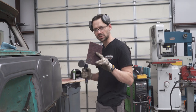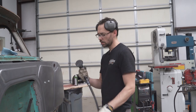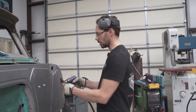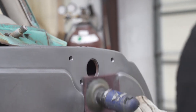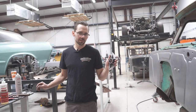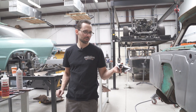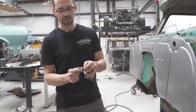Then I'm going to use some 80-grit hook-it three-inch abrasive for my DA sander — also from JAG10 Tools — to blend out the Scotch-Brite scratches. For the final step in our metal finishing process, this is a coarse red Scotch-Brite. We're going to take the abrasive disc off and just use the velcro backer part as we buzz around for the final blend.